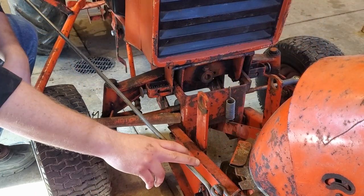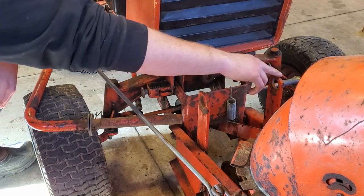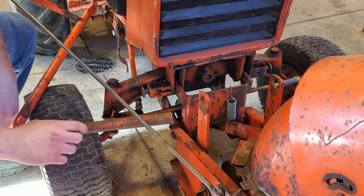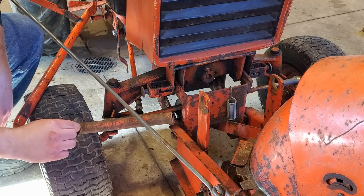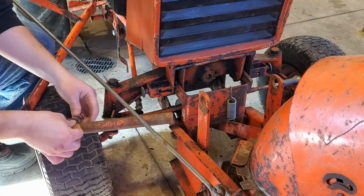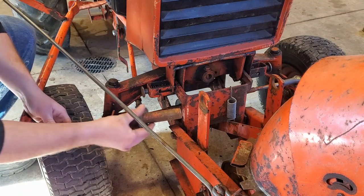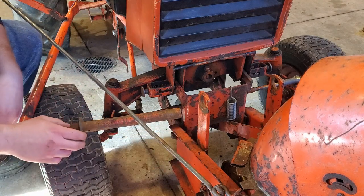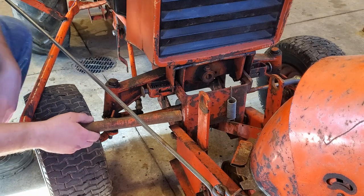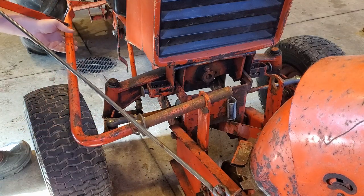So now we have the chute control rod connected, and we've got the lift arm that still needs to go through these two mounting bracket holes. How I store mine, I keep the two pins that are necessary, and in between the two pins I have two big washers. So remove the pin that's farthest away from the bend and keep it to the side, then take the first washer that was next to that pin. You keep the pin closest to the bend and the washer right next to that pin on. So now go right in through the first mounting bracket hole.